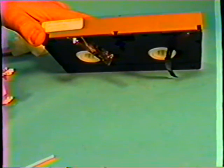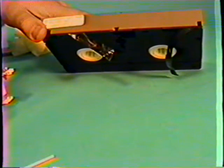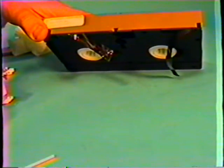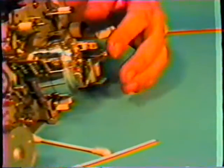Did it do any damage to the VCR? It plugged the video head, but did not do any permanent damage. They were very lucky. When you say plugged, what does that mean? Okay, the machine that we showed before where the picture was very noisy, that's what I refer to as a plugged video head. The active element on the drum assembly became clogged, and so it could not pick the information off of the tape. So a cleaning would remedy the problem. Yes.